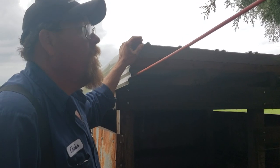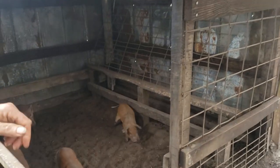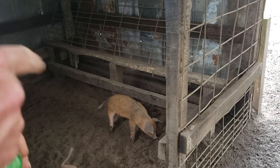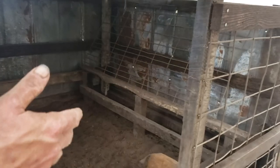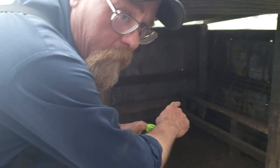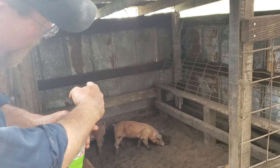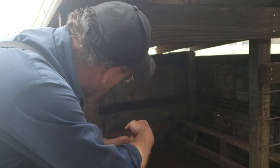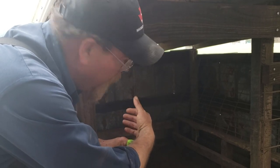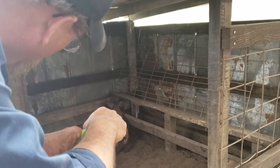Now these are the farrowing houses — they're taller because I have to get in them when the sows are having pigs. The construction is just a pole barn: posts with boards nailed up around it. You have to block off a side or corner and put what they call a pig board around the inside to keep the sow from laying on the pigs — it gives the pigs somewhere to go that the sow can't reach. One thing I did wrong on this one: I only used three boards for the sides, which isn't adequate. You need at least four — there's too much of a gap and not enough support. The side blocking also wasn't as good as it could have been. We kept what we liked and fixed what we didn't on the last one.